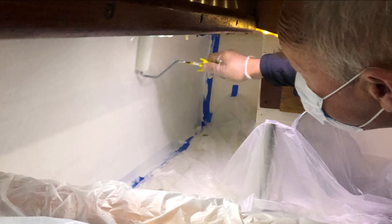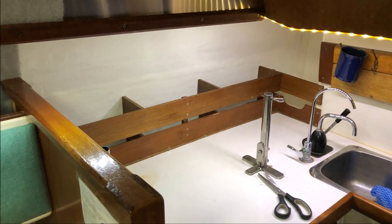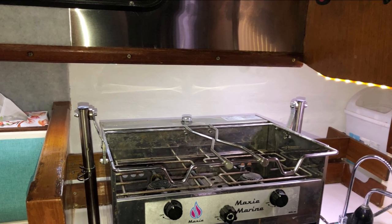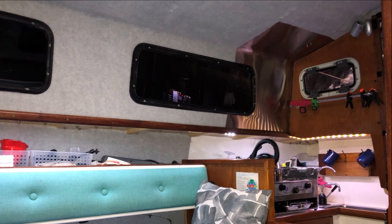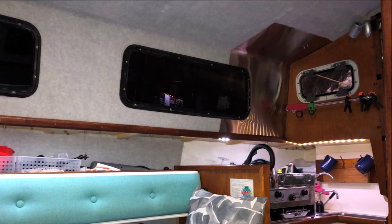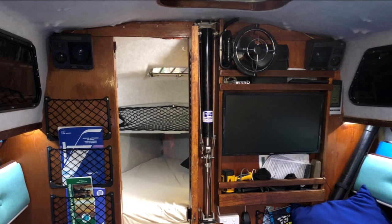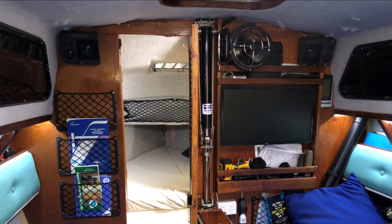My preference is to line the cabin instead of painting it for the insulation it provides and the lack of condensation. In the galley area the hull was cleaned, sanded, and two coats of flow coat applied. Above the galley, a sheet of 0.9mm 304 stainless steel was cut and formed as a splash back, glued in place with strong silicone adhesive. With the job complete, Naringa is now more comfortable and inviting than ever, and ready for our big Kimberley adventure.